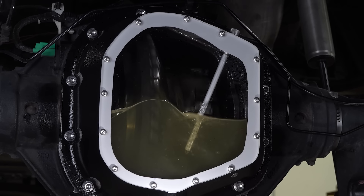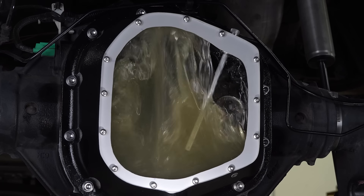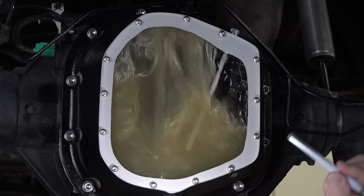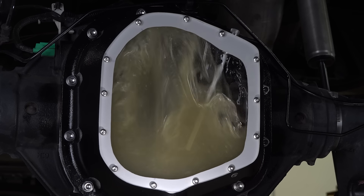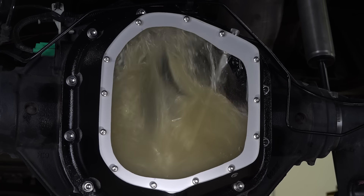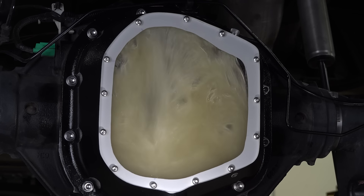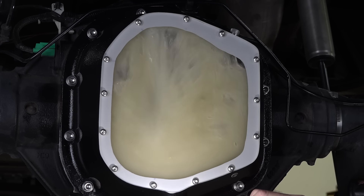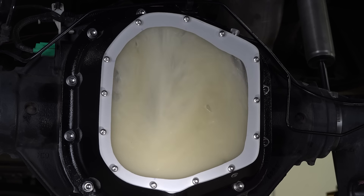I fear what we're going to see as we go up in speed. Let's take it to 15 — going from five miles an hour to 15. I can see it waterfalling off the inside of this surface. Very little is going around with the ring gear as the thing was designed to do. Let's go to 30. Let's go to 60. The fluid dynamics is so messed up — I couldn't even imagine how bad that actually is. It's unreal. Can you hear that blasting the cover? Because I sure can.